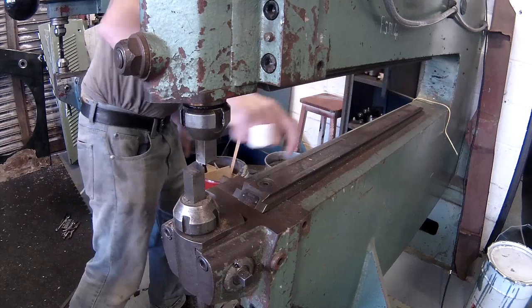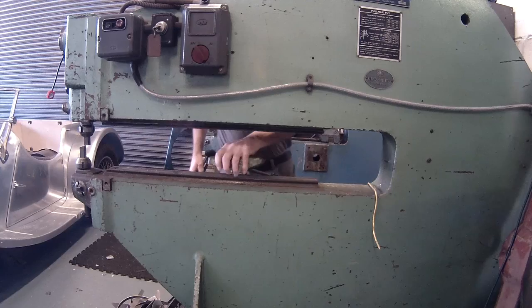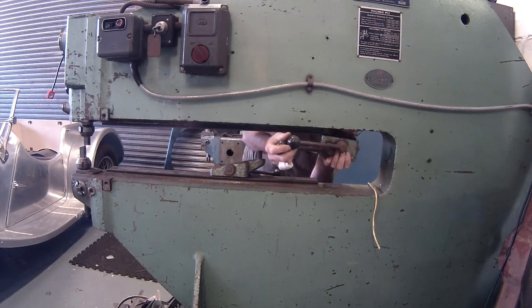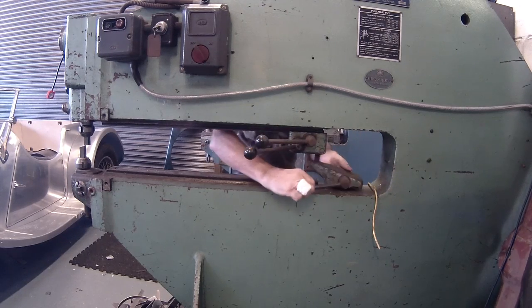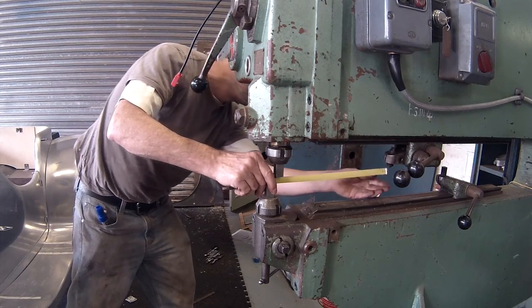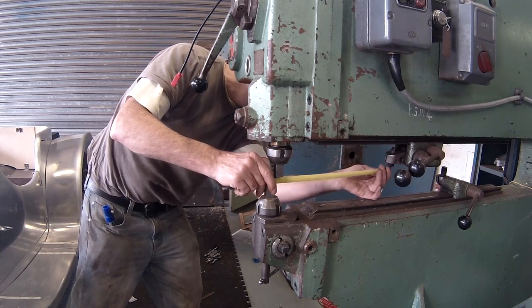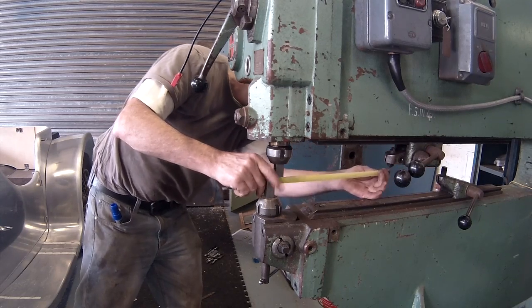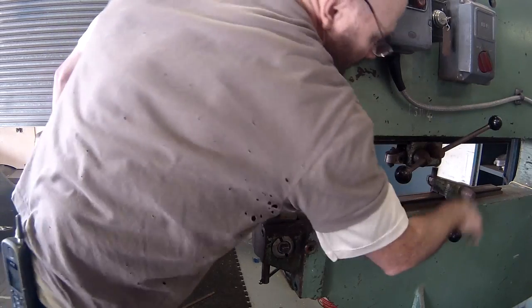For this job I set my P6 Pullmax up. The dovetails are set for the diameter and the circle cutting tools are put in the machine. Once these are set to the correct radius the hole can be cut out. In fact it can cut pretty much anything we could want, including freehand cutting, cutting slots, squares, even louvers.